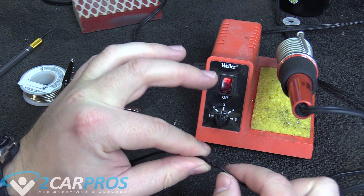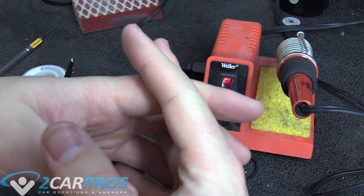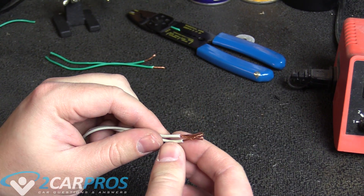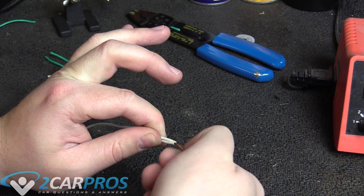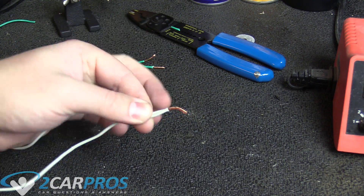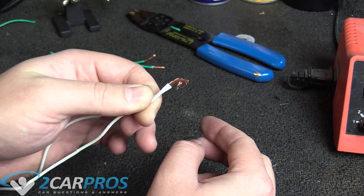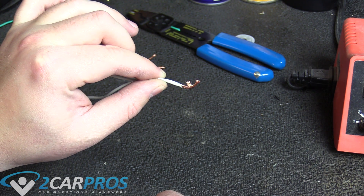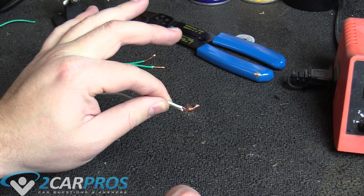My next form of soldering I also don't agree with, which involves folding it over and twisting it, because it creates the same thing — those little tendrils stick out and poke through your insulating material. Some people would have you put the wires together and twist them like this, together, and then solder them. In this perfect situation it seems okay, but the problem is you get a lot of frayed ends on the copper cable. See how easy that is to fray? If that pokes through your insulator — whether heat shrink or tape — that can poke through and cause a short. That's my problem with it.